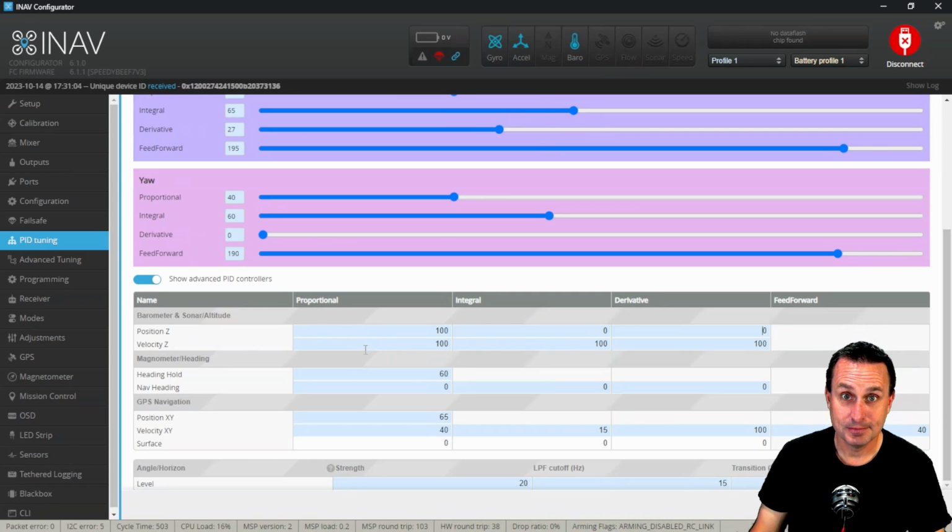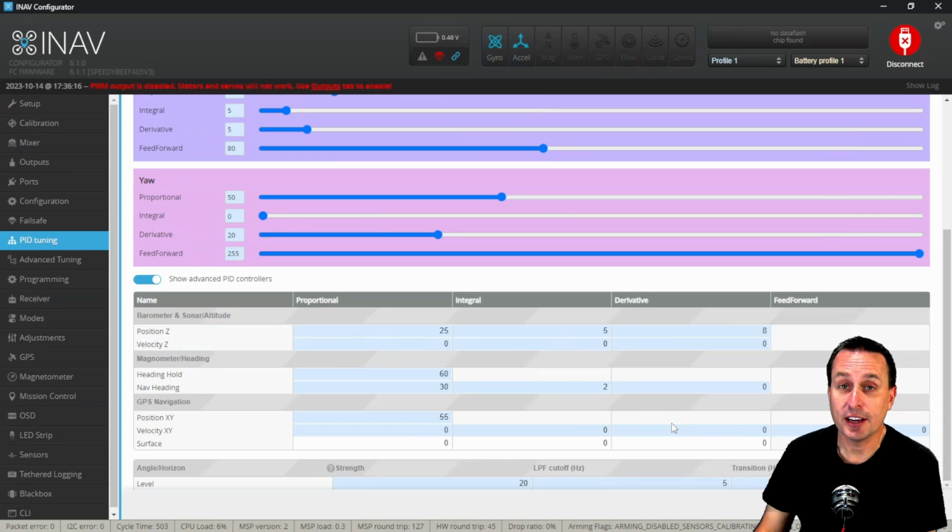So yeah. And likewise, when you're in an airplane mode or have the PIFF controller selected for the default of what you're using for the controller, you'll see that the velocity estimator here for Z are also set to 0, 0, and 0. Well, that's because there's no variable for them. So don't mess with these numbers. Again, this should be just grayed out or just not even here when it's in fixed plane mode, but that's just not how it works, at least in iNAV 6.1 so far.